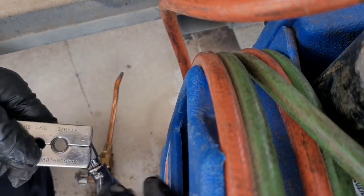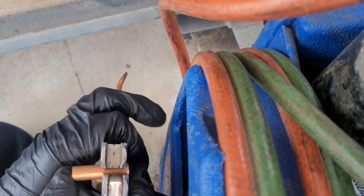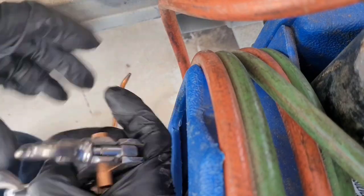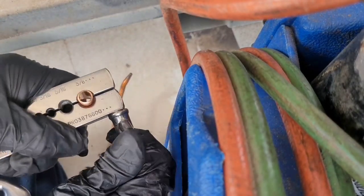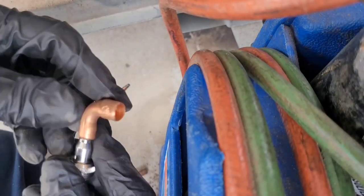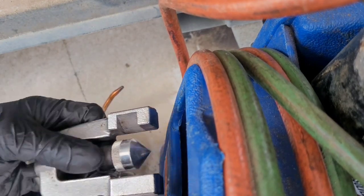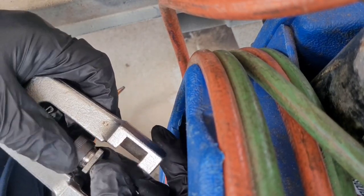With the swage kit you get your piece - it's 3/8" so it goes in this hole right here. Open it up, go about that far, then close it off. Get a good grip on it. Sometimes with these if you can't turn it anymore you have more leverage from the other side - loosen that one and turn this one a little more. Then find the matching die piece out of the kit for 3/8" - that one - and use it to shove this piece into the pipe, expanding it and making a coupling end.